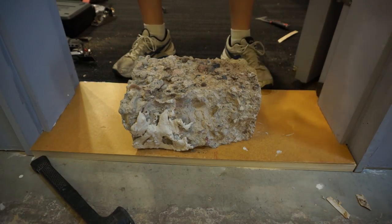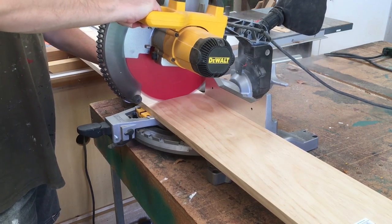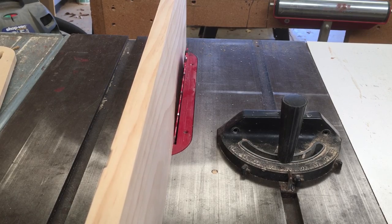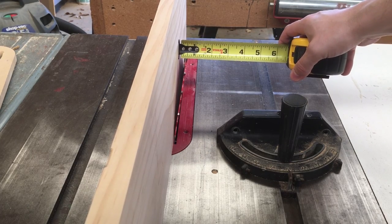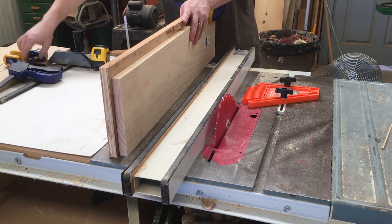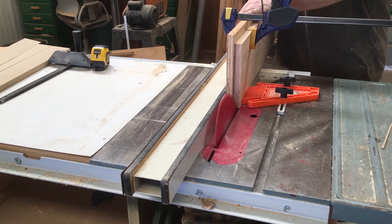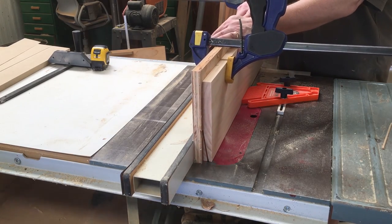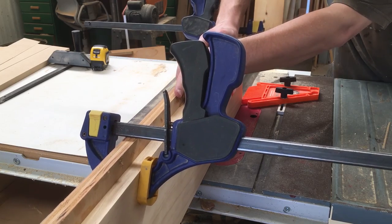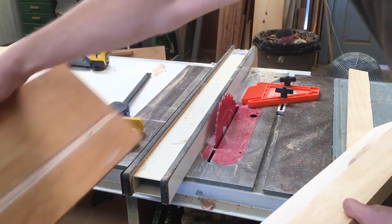The automatic door bottom still didn't work as well as I had hoped, so I decided to install a doorstop along the bottom as well. This would only be three-quarter inch thick so no milling needed. I cut an angle into the stop — not to any particular degree, just measuring off an amount at the max blade height. What follows is a pretty unsafe cut; I can't put the fence on the opposite side of the blade, so I attached the board to another piece to stabilize it and made sure not to stand directly behind it. And it worked.